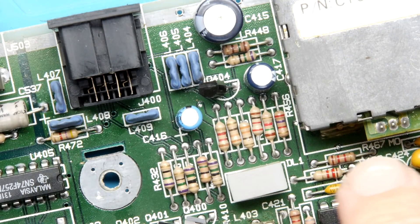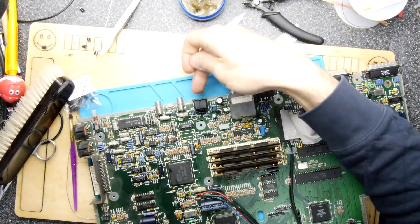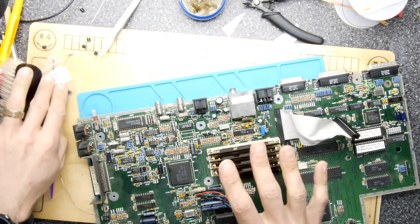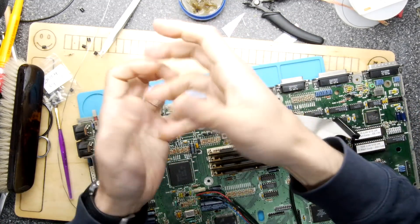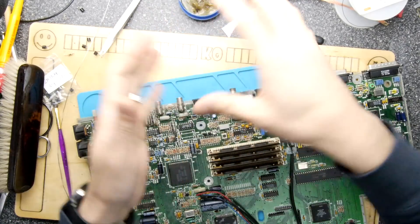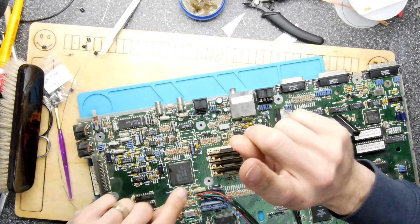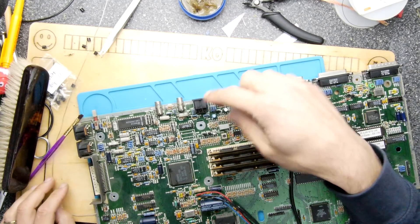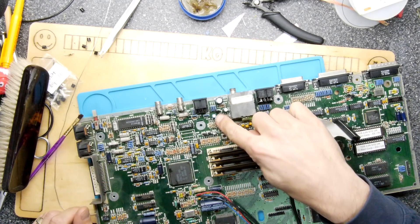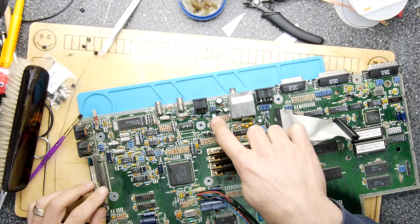After much playing around I discovered that when I set up my other Atari ST and plugged the monitor wire in, it wasn't booting — which was weird. I unplugged the monitor, opened up the shells, made sure there were no shorts, put it all back together, and it booted fine that time — it wasn't being held in reset. So I'm wondering if this is something to do with the monitor plug shorting something out.